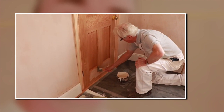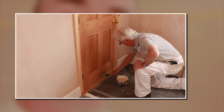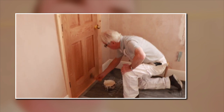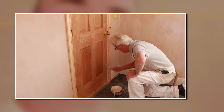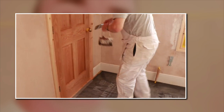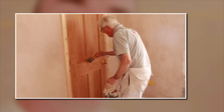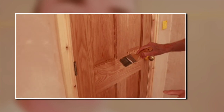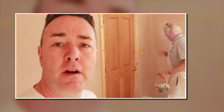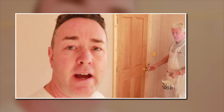So if you're asking how you'd price this sort of thing - price for the job done, not the time taken. Because getting a door finished nicely and painted well, I'll say it isn't a five-minute job. There's the door done - checking for any runs. Shouldn't get any runs or fatty edges, and there are none. This is the first coat so we're not too worried about getting too much on because it's going to soak in. You brush it out and then when that's all dry - 10, 15 minutes - people can touch it, it's all protected.